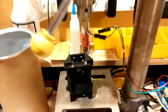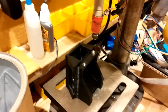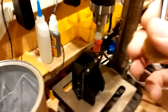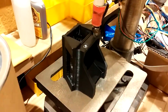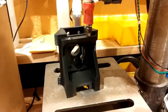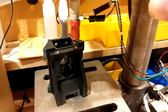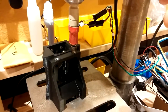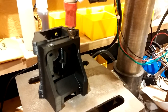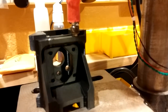So let me show you what this thing does. It's just a drill press — trusty Harbor Freight product. We're just turning this down here and it goes right there, and you wait for a few seconds while the heat transfers into the nutsert. Then as soon as it gets up to temperature, it'll start to press in.